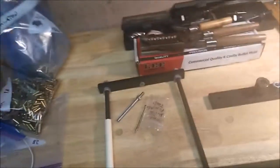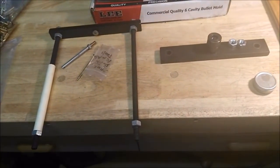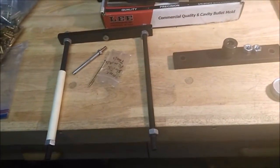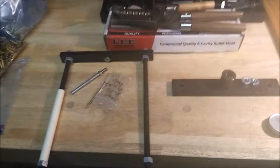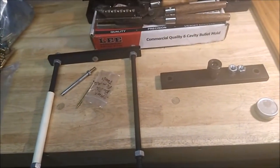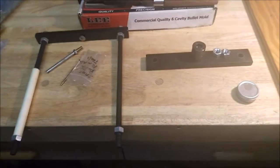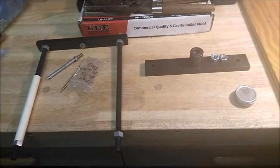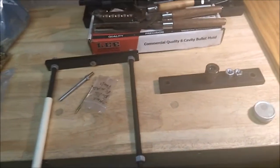Thing is, with the boat tail kit and the flat base, there are precise adjustments on the point form die that you have to make, depending on which one you're doing. You have to take calipers and adjust it right up, because the inside is angled. So if the inside is low, you just get a flat base, but if it's raised up inside, you get that boat tail. The rebated boat tail is completely different. It's basically straight walled, but there are two different inserts to change which base. So it's easier on one hand, but it's neither here nor there.